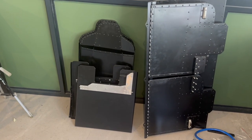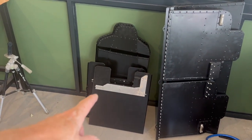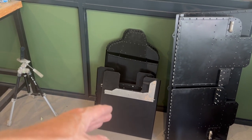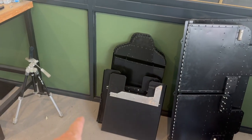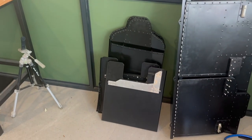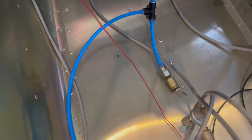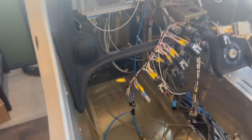They powder coated the piano hinge, which was fantastic because then it doesn't work, so I've had to break all that off. The mechanism here — Sling gave us three of one type of cable with a pin and one of the other, rather than two and two, so I had to butcher one and make it fit like the other because it just takes too long to get it sorted out. That still works fine. The aircraft painter came to have a look — he's going to paint the outside. I also gave him the brackets for under the instrument panel and the bracket for the alternate static, which I'm going to mount up just under here, out of the way. He's going to paint them so we can get on with installing them.